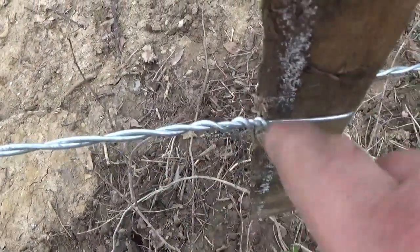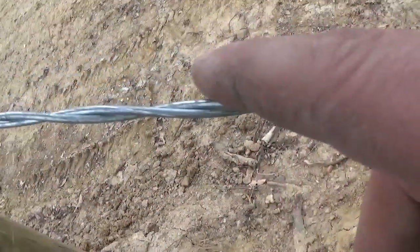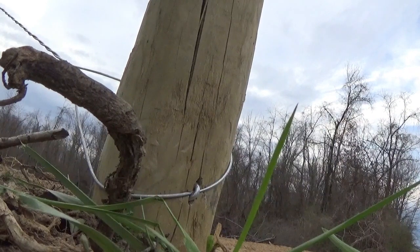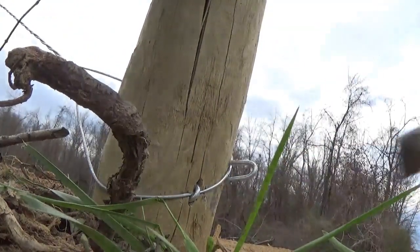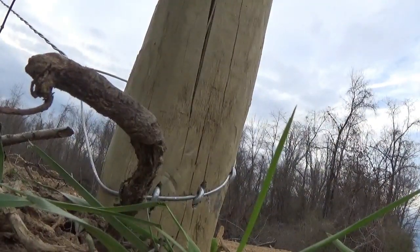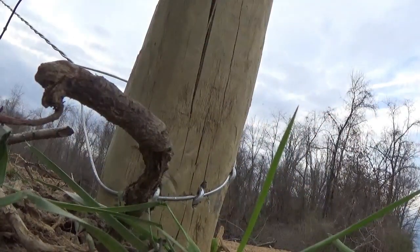You can see we've got a twist all the way from the turnbuckle lever, twisted all the way up — almost to the post. You'll feel it starting to get a lot of tension on that wire. Now it's time to drive the low staple home, now that we have all this tensioned. And just in case that decides to slip, come over about an inch or two, drive one on the left and drive one on the right. This needs to hold up because we're going to staple a fence to it and tug it with the tractor.